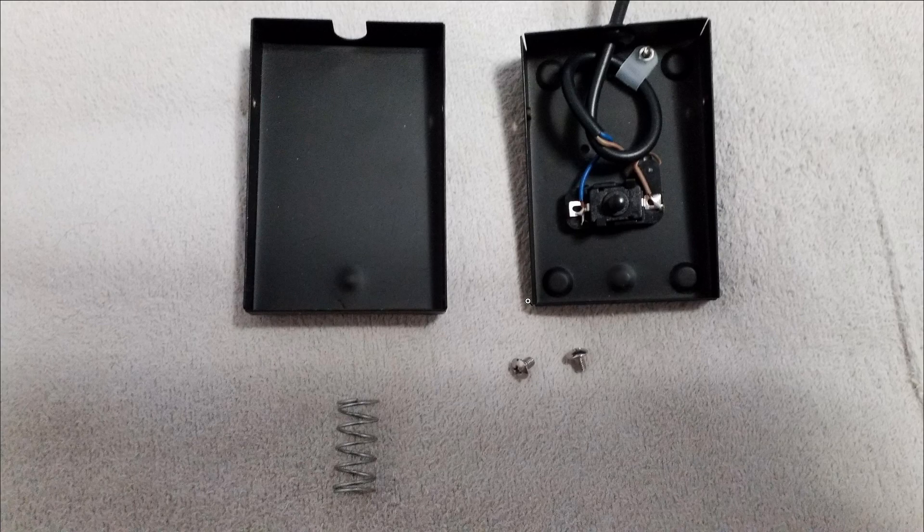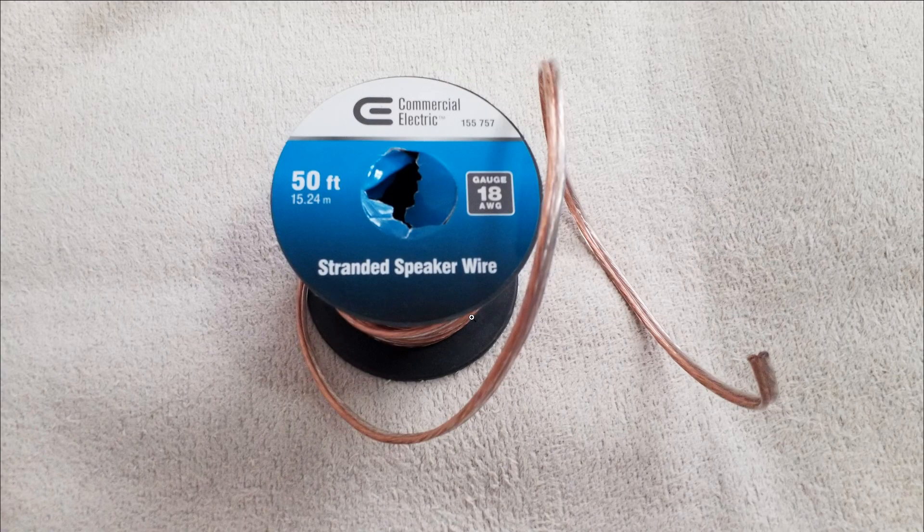So two different mechanisms — kind of interesting. I'm replacing the wire with this stranded speaker wire I got from the hardware store. It looks cool, and you've got one copper and one tinned wire. I think of this as red for power and silver as black for circuit ground. The benefit is it's nice and flexible, and since the two conductors are joined by plastic you can split them apart as short or long as you want. It's on a spool so you can make it as long as you want — I made it long enough to easily reach across an entire room. It's a simple switch, so there won't be any significant losses from wire length.